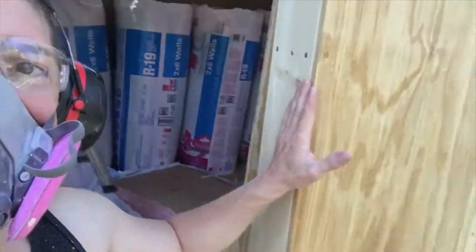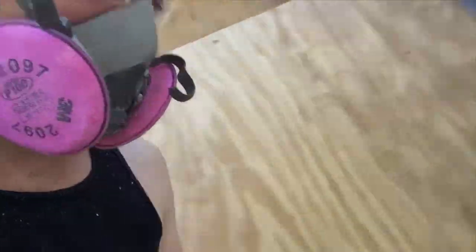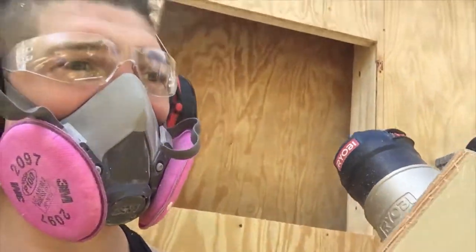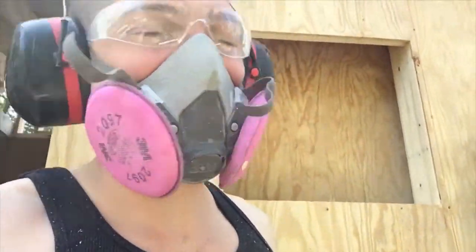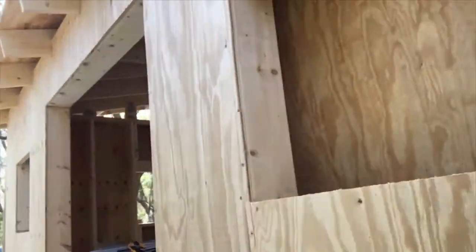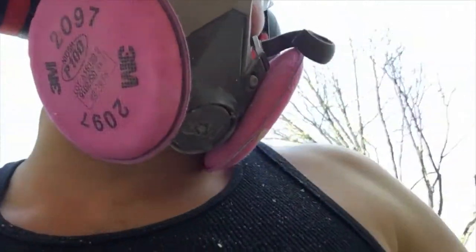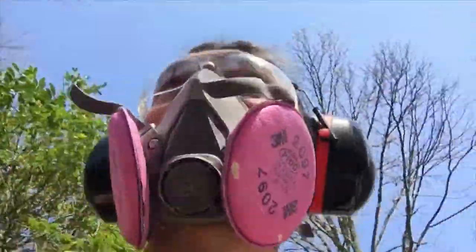I'm routing the windows and doors just to get this cut nice and flush. Picked up a router table at Community Forklift for maybe like 30 bucks — it was nothing, works great. It was the best router I've ever used, actually. Made a little face plate for it, just going around trimming them all up.